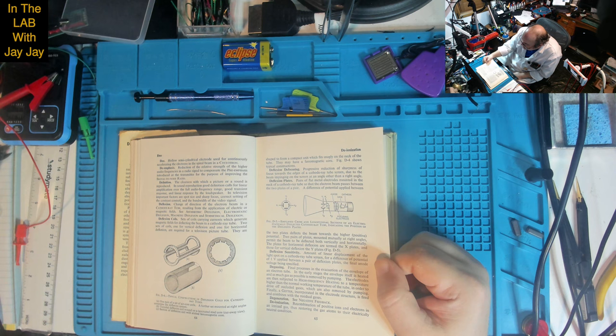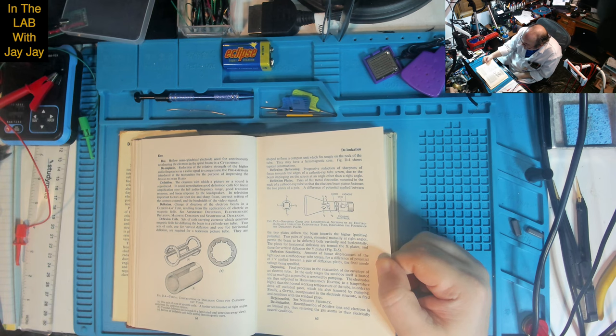In the early stage, the envelope itself is heated and as much gas as possible is removed by pumping. The electrodes are then subjected to high frequency heating to a temperature higher than the normal working temperature of the tube in order to drive off occluded gases, which are also removed by pumping. Finally, a getter incorporated in the electrode structure is fired and combines with the residual gases. Fascinating. So that's about cathode ray tubes. Degeneration,